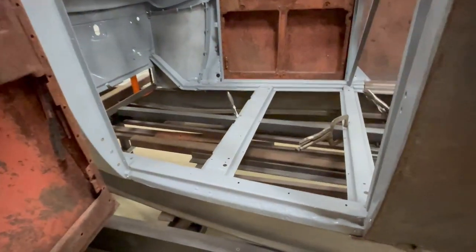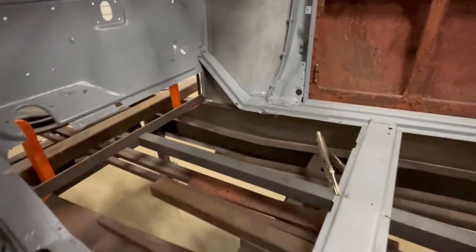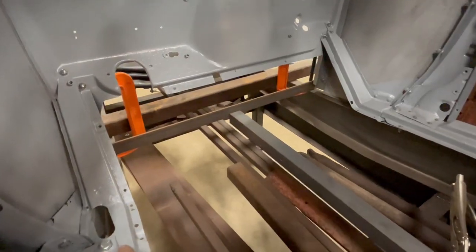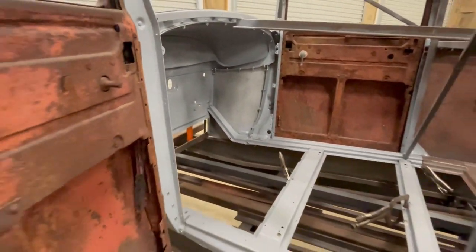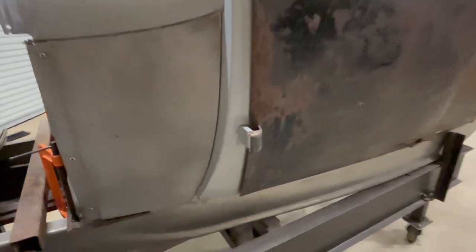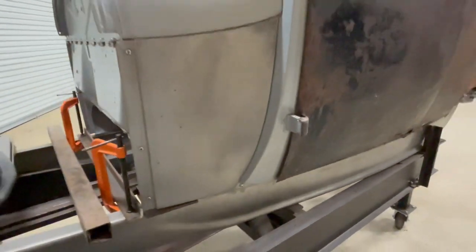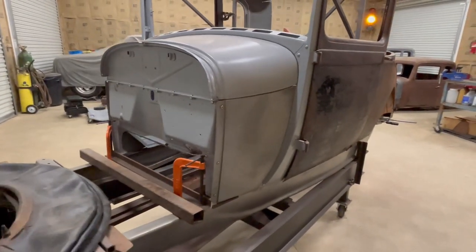We've been working on this car for a while on the channel. I got all the subrails up here repaired. We rebuilt these front pieces up here, the subrail extensions on both sides. Did a lot of rust repair on all that. Got the doors where they open and close well. We rebuilt the bottoms of the A-pillars down here where they were rusted out. We replaced the bottoms in those. We got a set of aftermarket cowl sides to fit up correctly.